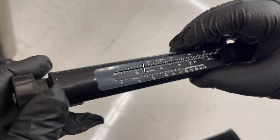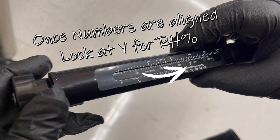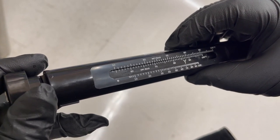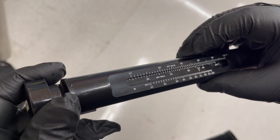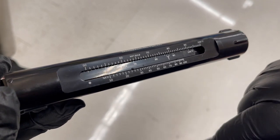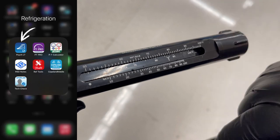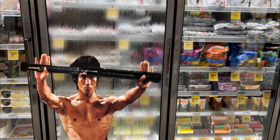On the sales floor, the wet bulb reads 58 and the dry bulb reads 63. Aligning those two gives a relative humidity of around 72-73% — it's hard to read precisely on the physical dial, which is why using the psychrometer app is helpful. Entering those numbers in the app confirms around 72%, meaning I'm about 13% off from what the controller is showing, so I'll need to adjust that.